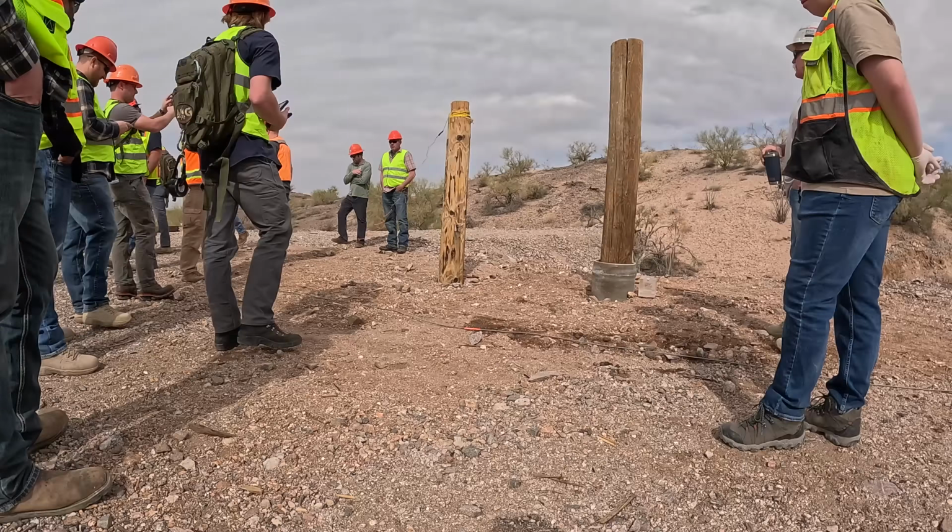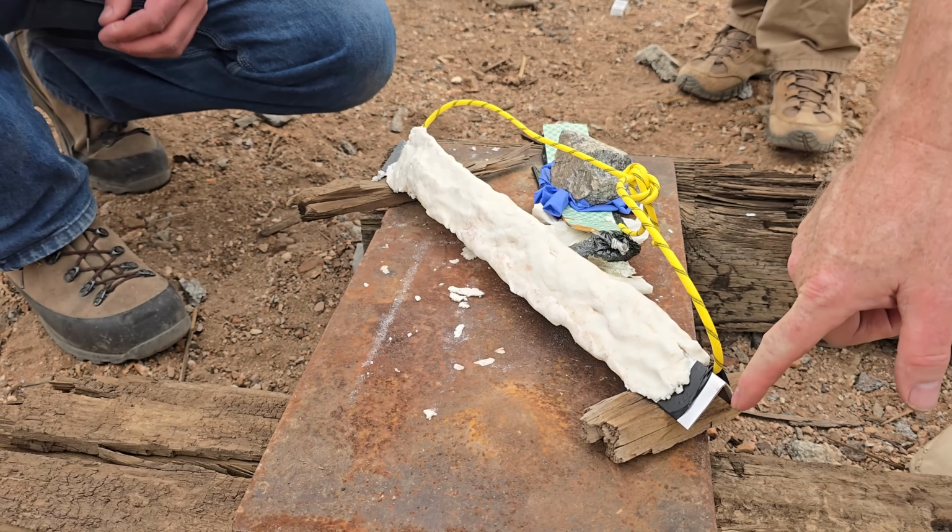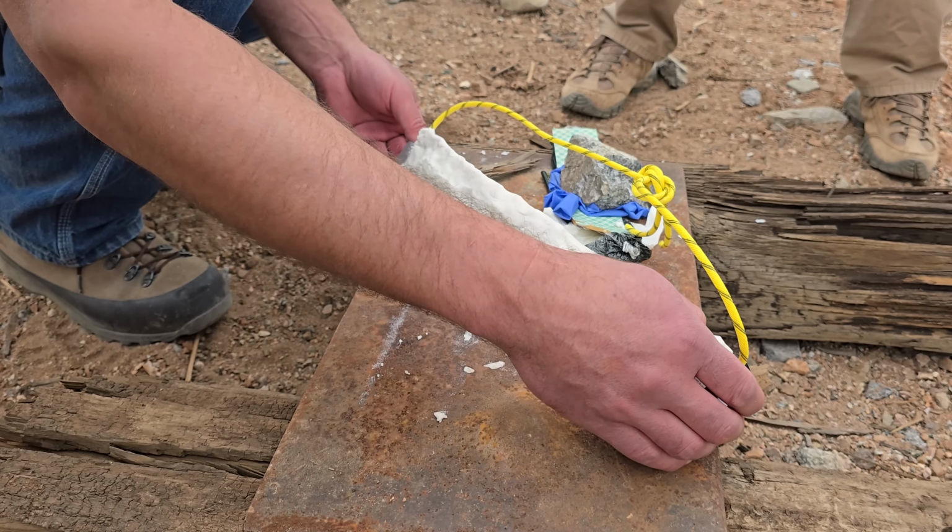Hopefully. With a beveled edge, ready to go. Yeah, perfectly. You're just ready to weld, exactly. It's going to be a little bent. You're going to have some prep work to do. What the plan was, I was going to have a little bit offset, but we should just set it up like... Yeah. Because you want it 2.5 times the diameter ideally. Like on this corner, it wouldn't cut that corner. It'll stop right there. So you've got to overlap a little bit.